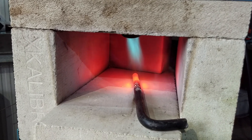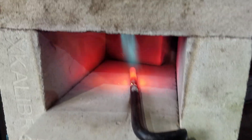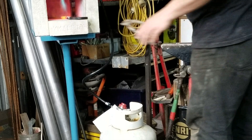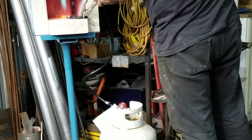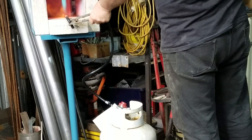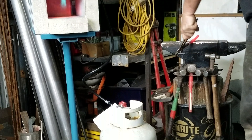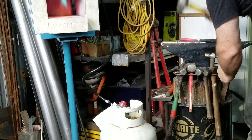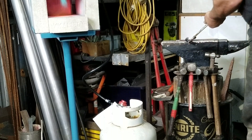Turn the forge down nice and quietly and a piece of steel should be able to sit in there for as long as I like. I can bring two pieces up to temperature, take one out and work on it, have the other one sitting there at temperature, then swap them over as the first one cools down — saving a lot of gas. I don't even have any tongs yet, so I'm going to use an old pair of slip grips. But now that I've got a forge, I can get forging. That's really horrible though — next video is going to be a tong-making video.